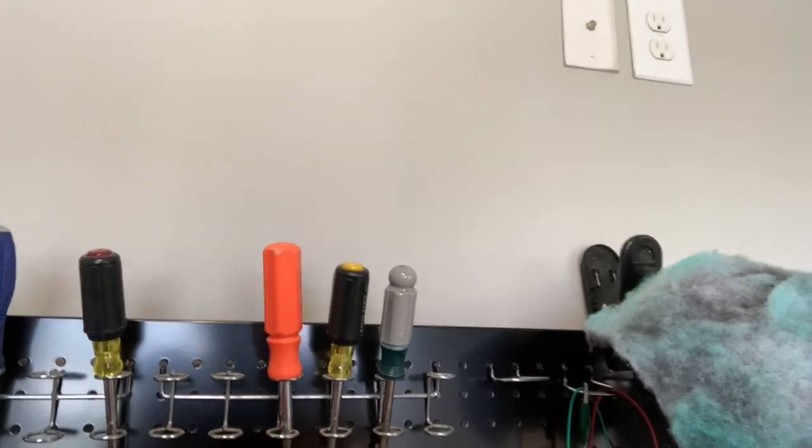I'll show you my hygrometer. We keep things in the shop as close to 50% as I can keep it, because 50 to 55% is where these instruments want to be. So we try to do it right here. And I let these things set and dry for about a week, at minimum a week before I start messing with them. That way I know that there's no extra moisture locked into the dovetail or the tenon of the joint, the pocket of the joint. You know, I want to make sure it's nice and dry. So that's where we're at.